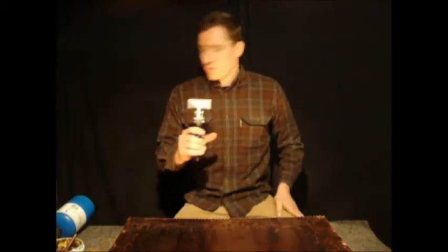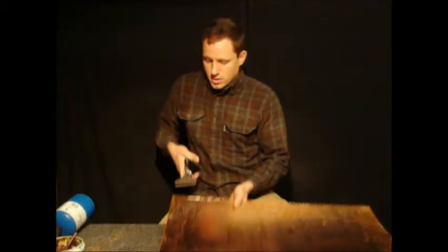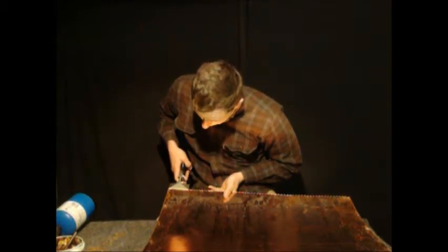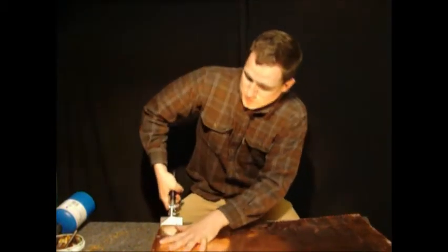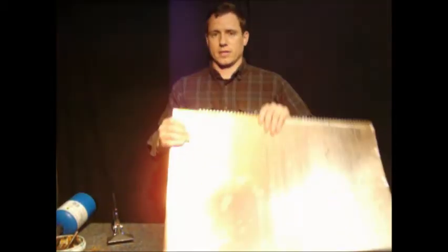The tool we're going to use for this is these sheet metal benders. You can use a regular pair of pliers as well. What you want to do is basically line your pliers up with the very top of the tab, clamp down on it, and then just bend it at a 90-degree angle to the boiler. So it looks something like this.